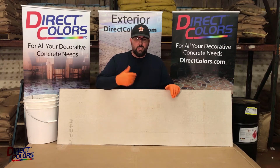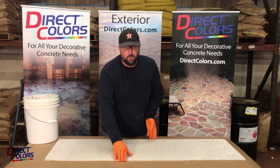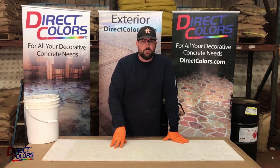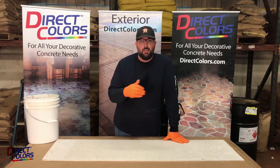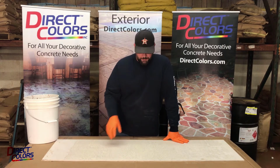So what I like to do whenever I'm overlaying on a piece of backer board, say I'm refinishing a countertop, or if I'm building an outdoor kitchen or something like that, I'll apply this backer board to a 3/4 piece of plywood, screw it down with some corrosion resistant screws, fill in the seams with a caulking or epoxy, and then come back and overlay over the top of it.